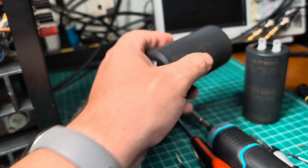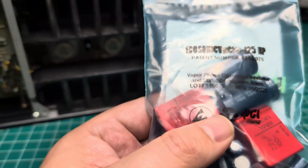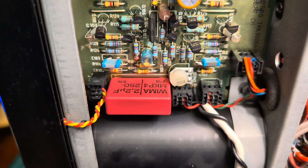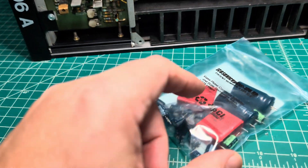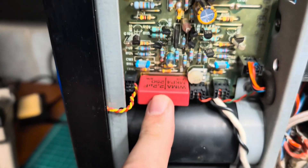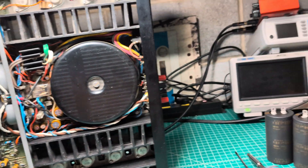That's what I'll be installing. And I replaced these red WIMA capacitors with brand new WIMA capacitors. The originals were rated at 160 volts; I couldn't find those so I installed 250-volt versions. They are the same size, so they fit quite easily.